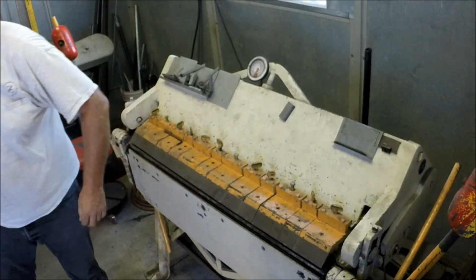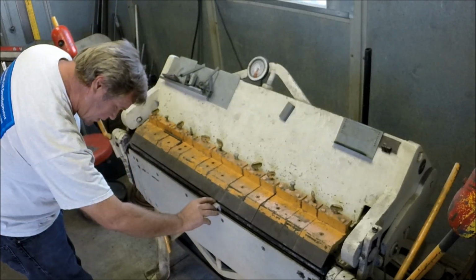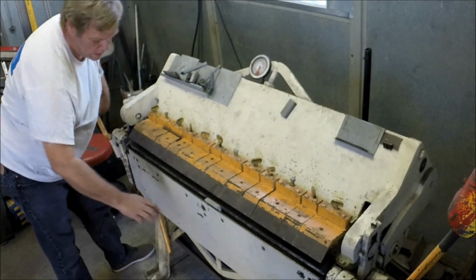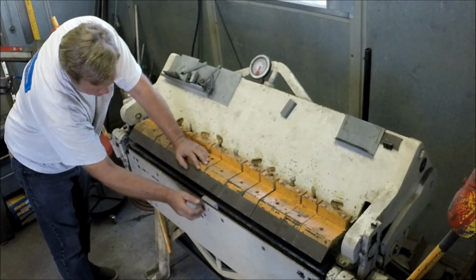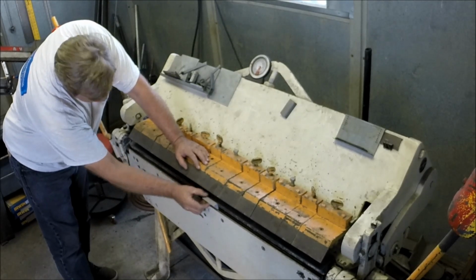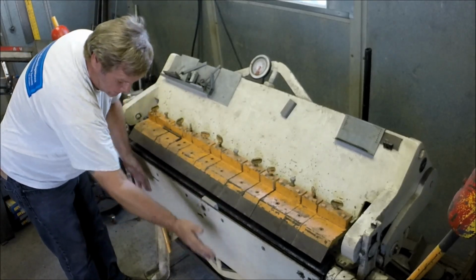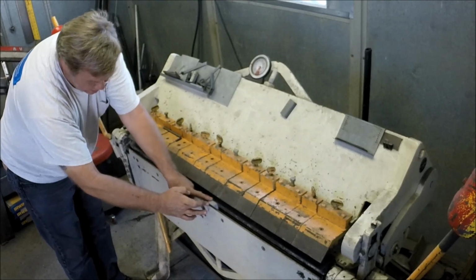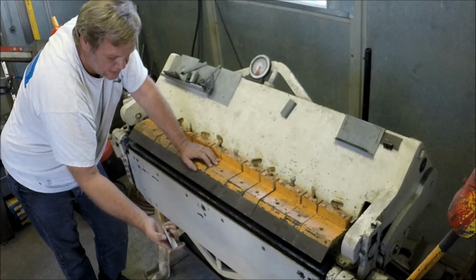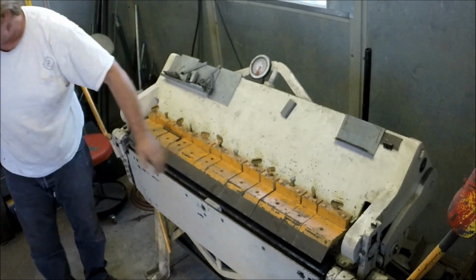And see how his apron die fits my machine here. That's pretty good. All right, it's a good height. What you're looking for here is when the die drops in, you don't want it sitting proud. And if it does sit proud, what you have to do is come here and loosen these bolts and these bolts, and there's jacking screws on the bottom, and you raise and lower your apron until this is flat. So it's good practice to have your dies cut or trimmed down to the back so they all drop in the same. No muss, no fuss.